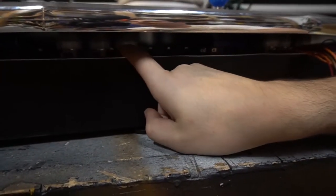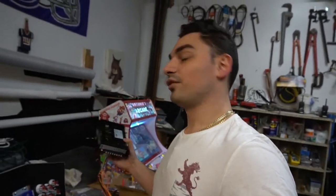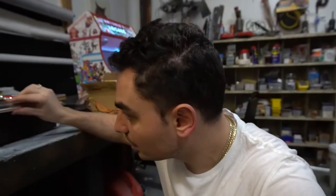If I put the power supply even in the middle, it's gonna clear my back buttons — but we're resting on the joystick and resting on button six. It's elevated, and you're gonna put a lot of stress on the buttons, especially once you add wiring. We didn't even add the wiring yet, so unfortunately no — the arcade power supply cannot fit inside this control panel. That means if we build this on a stand, we'll probably have to put the power supply on the outside of the unit somewhere people can't touch it and shock themselves.